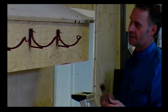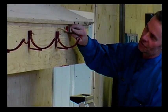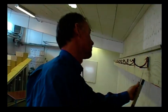This bracket, on the other side of the downpipe, should be placed slightly higher. It should be at least the same height as the last bracket on that side of the pipe, to get a slight gradient from that direction as well.